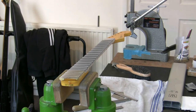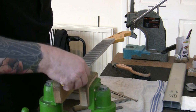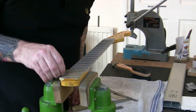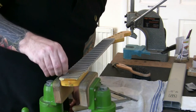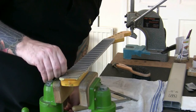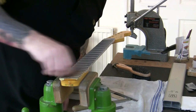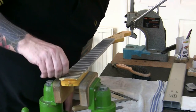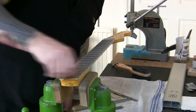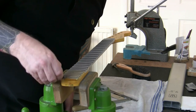Here you go. And how I do it, once I've done the six grits of paper, is I take the steel wool and I go all down the side of the bevels first. Then I will come over, and it's just a matter of getting in over the top, getting in each side, far side, near side, then back over the top. And these are fantastic. Look at that. No polish on there. We don't need polish. Why do we need polish? I've never used polish for polishing frets. They are beautiful. I cannot wait to get this tape off